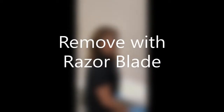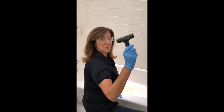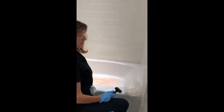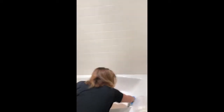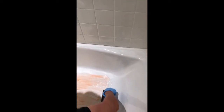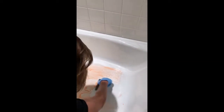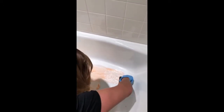20 minutes have passed and we're ready to strip the tub. Get your razor, get some paper towel in your hand, and have a bag ready for your refuse. Starting at the back edge of the tub, take the blade underneath the non-skid and just start working it through, peeling it up. You'll see it sort of wheels up in a clump — and this under here is my original bathtub surface. Just work through the tub, peeling the finish up and working throughout the entire tub.